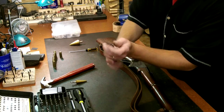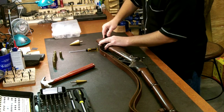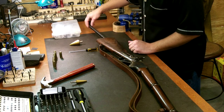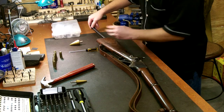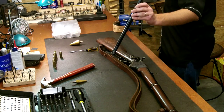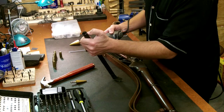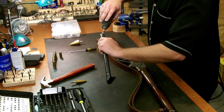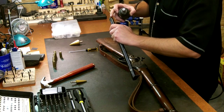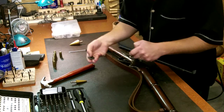Give it a little tap and you'll slowly start to flare out the metal part of the tube. Reinsert it into the stock and keep testing until the tube is snug but not so tight that it can't be reinserted — you want it snug against the tube inside the butt. Once you've done that, take your Dremel tool with a sanding drum and just sand very lightly. You don't want to sharpen the edge, just cut down the rough edge around the inside of the tube. Or you can use a piece of sandpaper and do it the old-fashioned way.